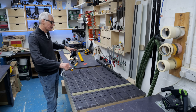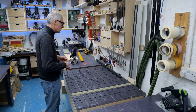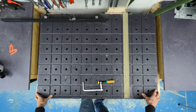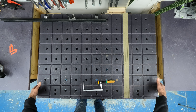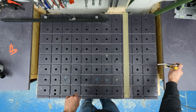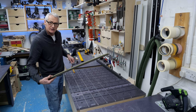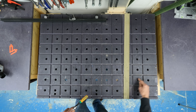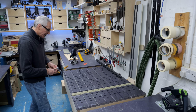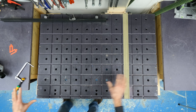I've got a few problems. One main one is that I have about 20 years of regular MFT muscle memory to work against. The biggest issue really is that the workshop MFT is in a run of benches — there's a bench on either side, clear access from the front, but access to the rear is quite difficult. I also have a sacrificial strip for the MFT, which means getting a clamp in from certain sides is awkward or requires removing the strip.